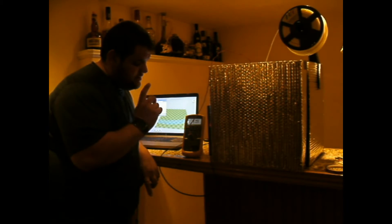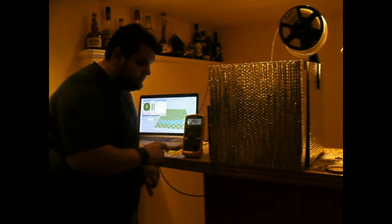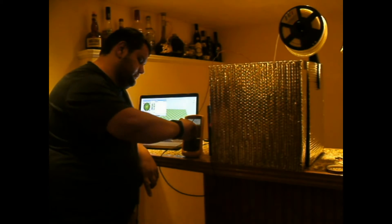Two hours into my final test print, you can see the build chamber is at 48°C, so it's got a good temperature to prevent cracking, warping, and bad delamination. Here's a shot of the LulzBot with the heated build chamber attached, with my Flir Lepton module. You can see there's some heat leaking out where some of the Velcro is. The Rambo is pretty cool — that's the black box on the left — and the reflective panels are pretty much the same as ambient. That was the position of the thermocouple during testing, about the center of the LulzBot Mini, and we got up to 48 degrees Celsius.